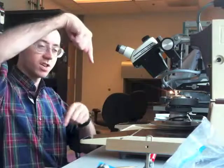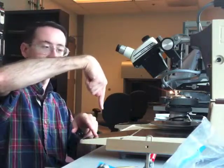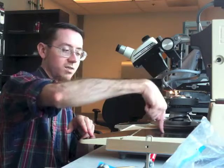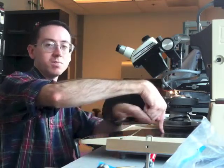What I like to do: I first go down like this — that's my first contact. Then I go to the second. This is where it's always been the tricky part. If you just go down and bond, you're going to get it laying across the surface of your chip — that's bad, particularly right in this area. The wire will be laying across any features there.